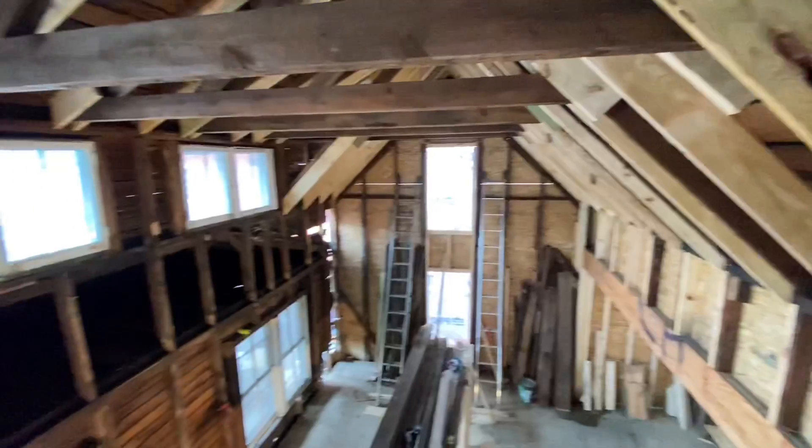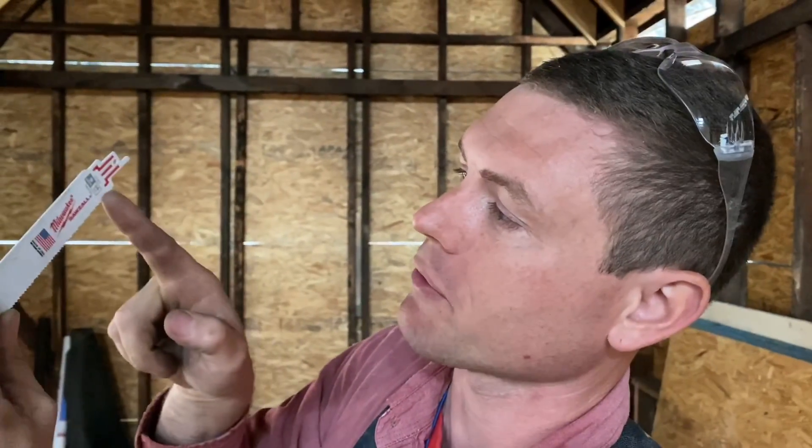But actually it was a very difficult process taking many days for me up on a scaffold. We would take the rafter and screw it in at the bottom edge and then push up as hard as I could push — you couldn't push the bow out of the roof. So we took a giant timber lock, a six inch screw, drilled it through at a very shallow angle upward and then drove it in until the drill starts smoking, hoping that it pulls up enough and hits the top of the roof decking making the roof flat.